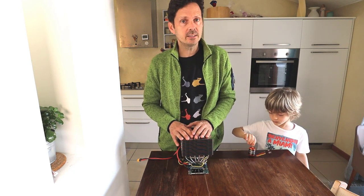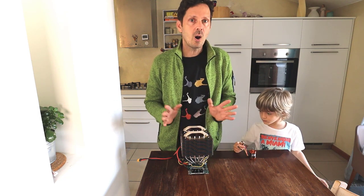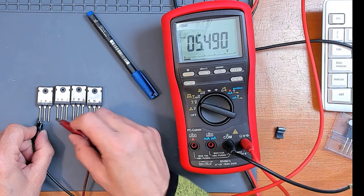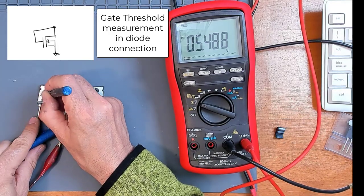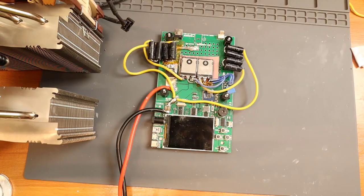They sent it to me free of charge and I was very impressed by their open mind. I selected a strong MOSFET which should be able to dissipate 450W with a heat sink temperature of 60 degrees. So with two of them I should be able to dissipate 600W and also be able to withstand some mismatch on the power distribution. I measured the VGS threshold of four MOSFETs and selected the two closest to each other.